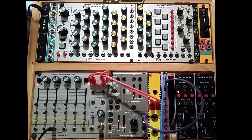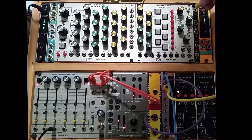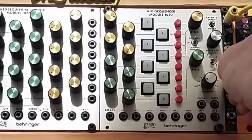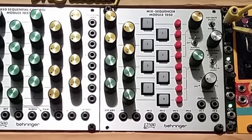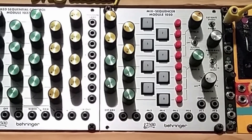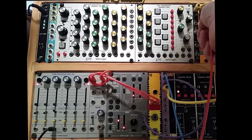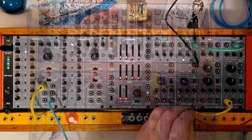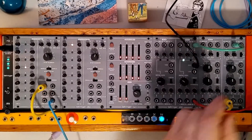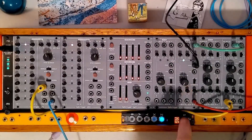But wait, we're not finished yet. If we take another output from the multiple and go into the clock divider, we should now get a blinky here. These are two separate circuits — the DIV 2HP clock multiplier divider. Counterclockwise you slow the clock output down; to the right you turn the clock output up. We'll take the clock output, use this upper circuit, and put that into the gate of the VCA. With the initial gain down, that's the last piece of this little puzzle.